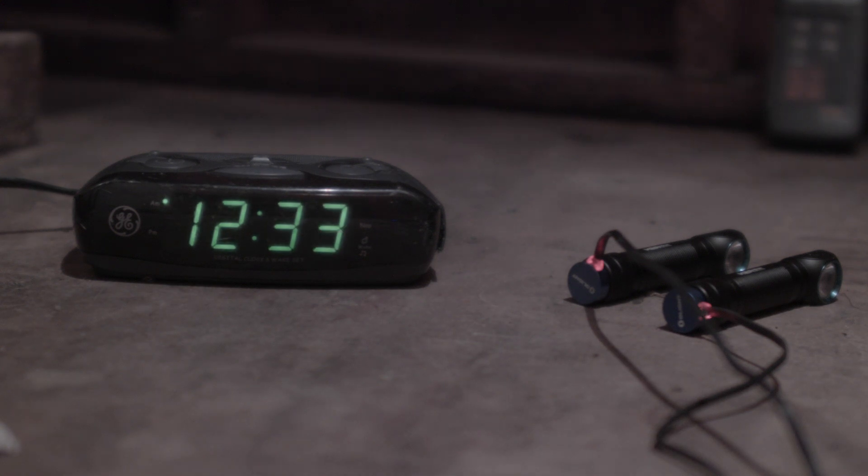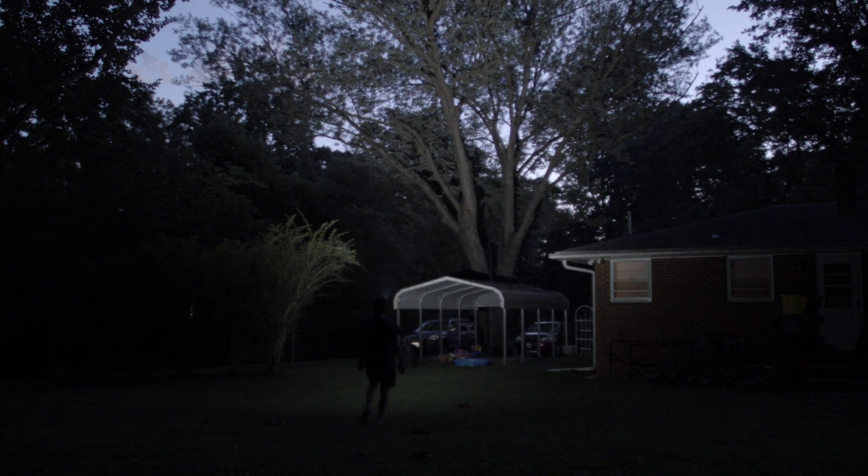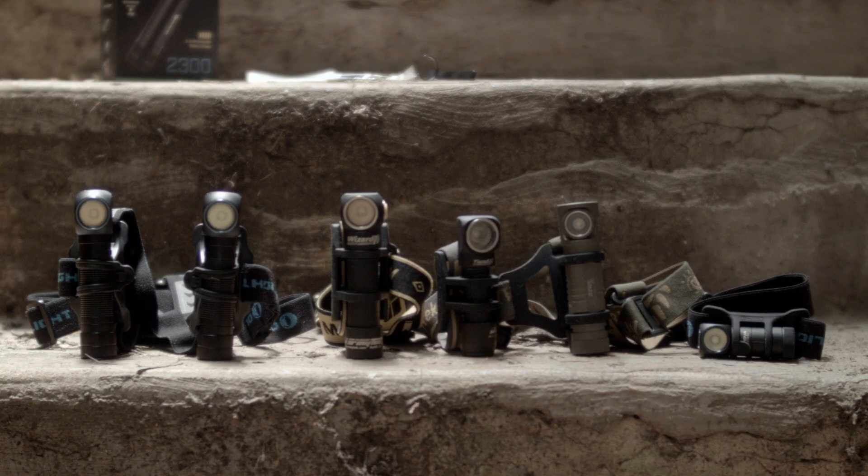Charging is a breeze. While you can use other batteries in this light, you can only charge the included battery in the light. When charging the indicator light is red, and green when fully charged. The charge test was done right after the medium runtime test when the batteries were at 2.86 volts. One finishes charging at 4 hours 36 minutes, and the other at 4 hours 59 minutes.